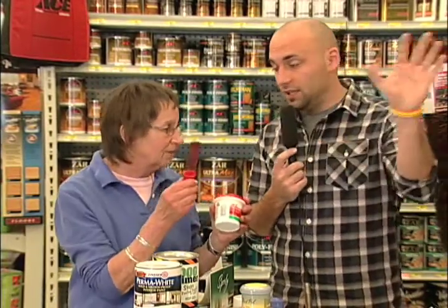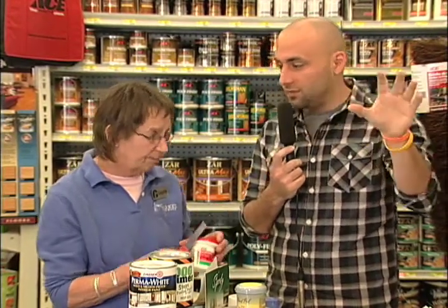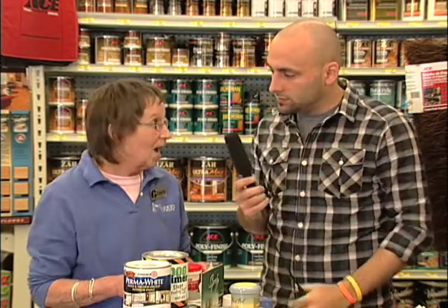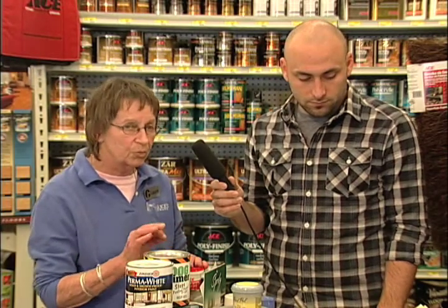So all right. We've cleaned the walls. We've got everything fresh. We've patched holes that may have been left from nails and frames and stuff like that. Now, do you always have to use a primer? I would assume if you have a green wall and you want to paint it white or something like that, that may be obviously a good option. But do you always have to prime the walls? I didn't. I was really lucky because there were some bad stains, and the paint that I used covered in 2 coats. Well, in 1 coat really well. 2 coats was perfect. And now they have paints that have primer in them as well, so you don't have to do the 2 steps. You can just do the 1.